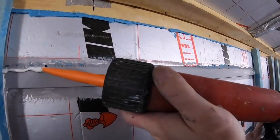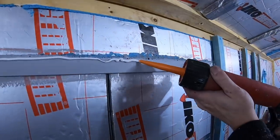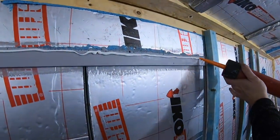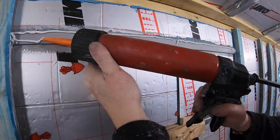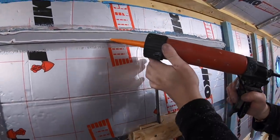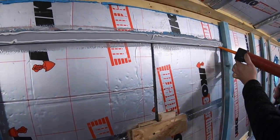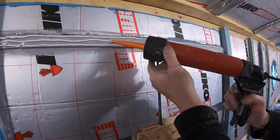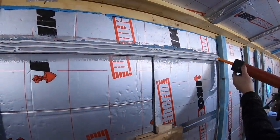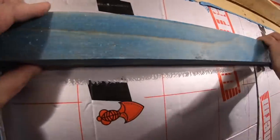The insulation that you can see on the hatch doors is a temporary fix, really. It was just to keep us warm in the cold spell, that was all. They're going to actually be removed later on, and they'd like to be trimmed out and fitted with some nice timber. The battens were flush fitted to the hatch frame, and then once we'd pushed them onto the adhesive, we screwed them from either side.